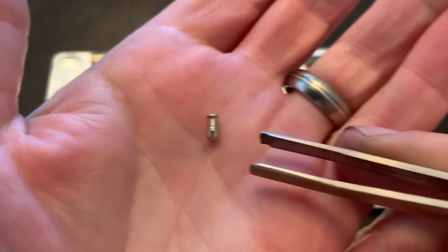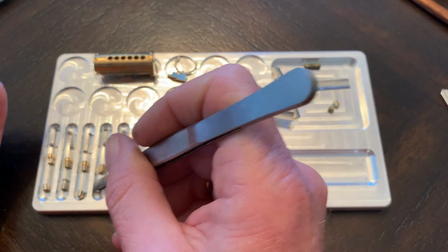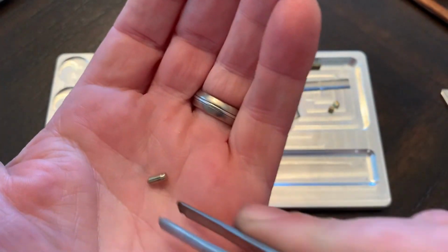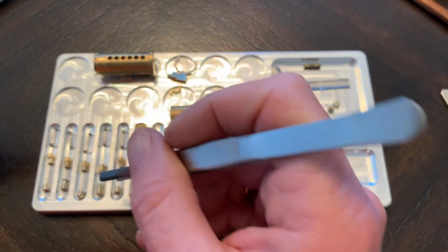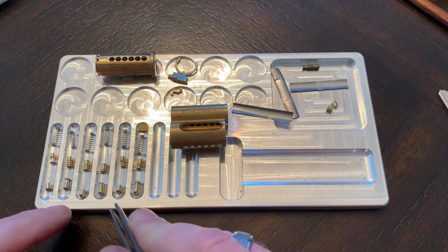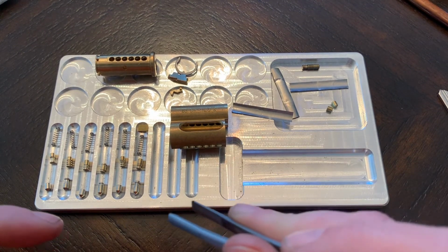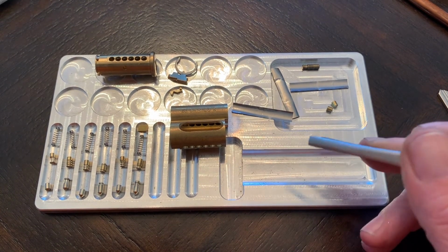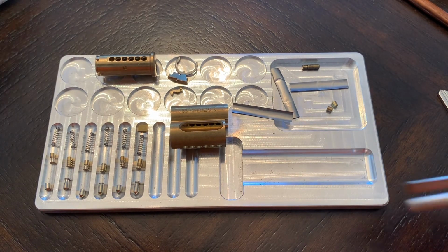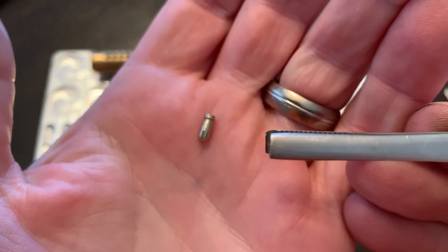But number two, torpedo overset. And we'll just do the bottom pins first as they roll away. A little serration on top on these nickel silver pins. People wonder, American locks, we don't have the steel pins. These are nickel silver, so they're a little harder, but even though in the keys that are nickel silver, where are, I don't have one. Yeah, I do. No, that's brass. The keys have kind of a goldish color, but the nickel silver pins are silver.